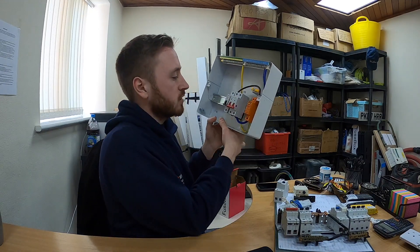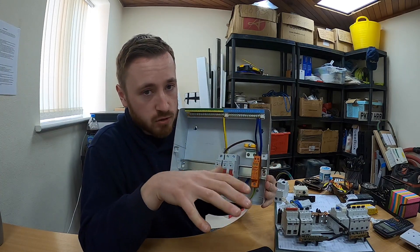There's another way you can run the cable for the electric vehicle charger, which I personally disagree with a little bit. In your electric meter box, what they do is fit a sub-board — they cut into the main supply and fit a small sub consumer unit that has the correct protection for the cable. I personally prefer that all cables are connected directly into the fuseboard, so there are no surprises and you know exactly where everything is. Meter box lids often get broken or blown open, so I tend to avoid that approach — but it is possible.